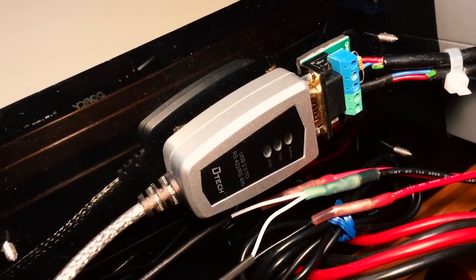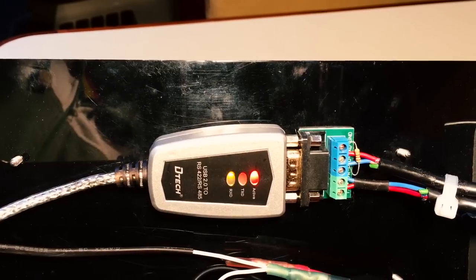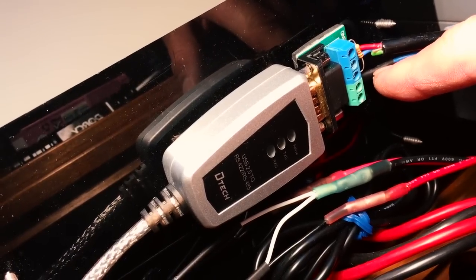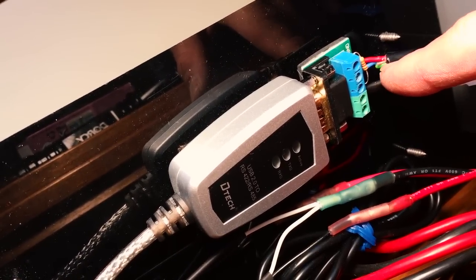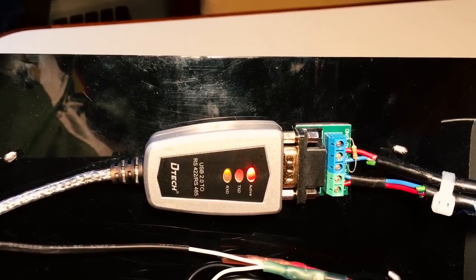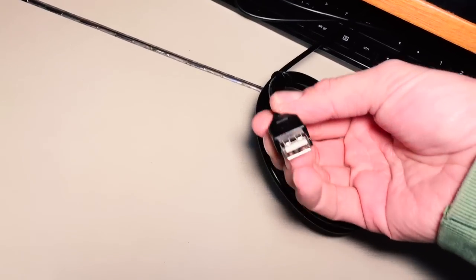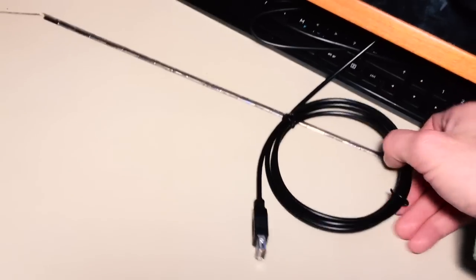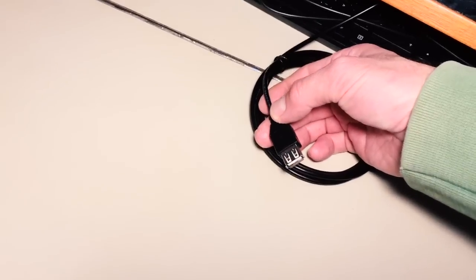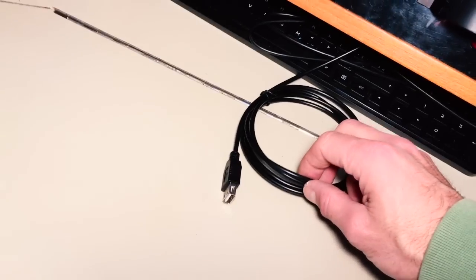If you're installing an autopilot with your Raspberry Pi, it's really important to get a USB-to-serial adapter that handles both TX and RX — transmit and receive. One wire outputs NMEA 0183 and the other inputs it, allowing the Pi to talk to the autopilot and send the appropriate NMEA data to move the rudder. I also found it helpful to have a USB female connector accessible from outside the console so you can plug in a jump drive — useful for copying charts over.